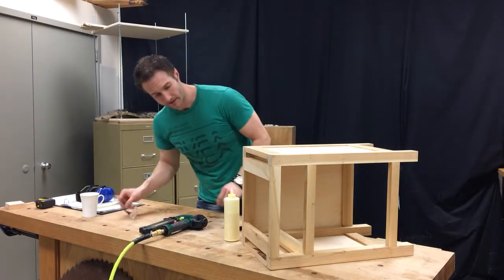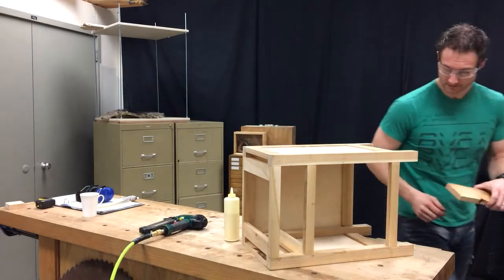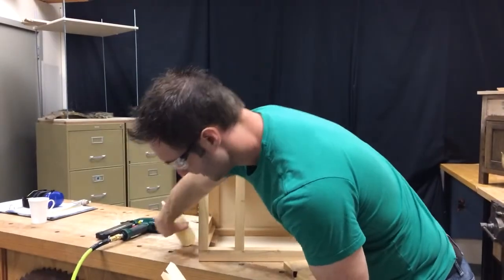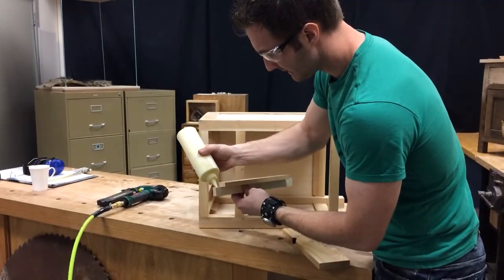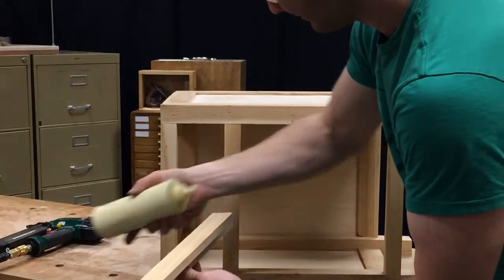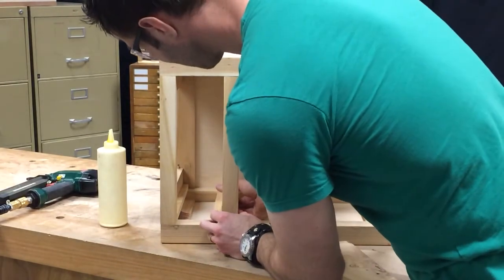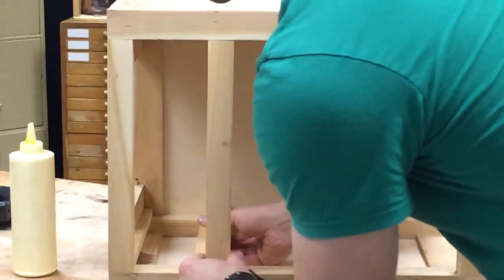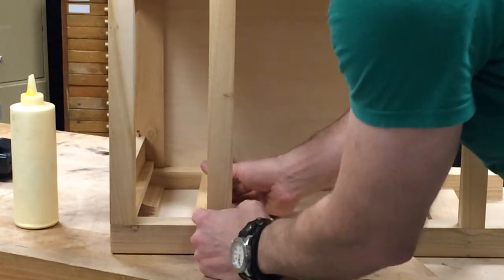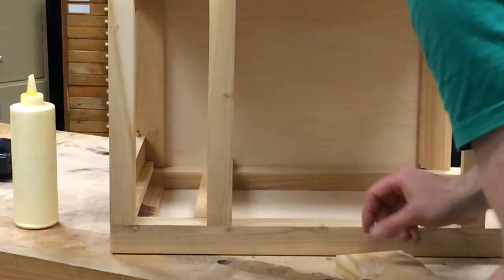We're going to be very careful when we use this. We're going to use safety glasses for sure. Let's go ahead and actually install this thing. I'm going to prepare this drawer guide by putting a little bit of glue on it — we don't need a ton of glue. You guys know by now that less is more when it comes to glue. That's going to go in here, and I want the bottom part of the drawer guide right flush with the top of the front rail.